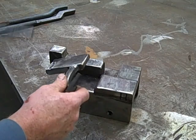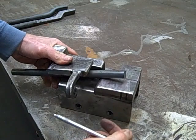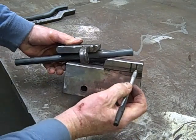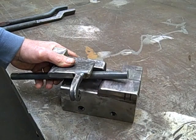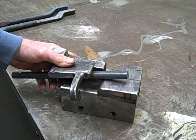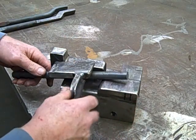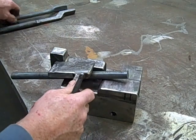As we begin our sequence, the steel is inserted into the jig, and if you'll notice here, there are two marks. They're simply arbitrary, which tells me how far in, or how much material I want on the working end of my tong — so that determines it. So what we're going to do is to drive this arm down, and that will give us our offset.